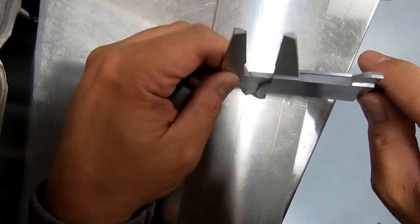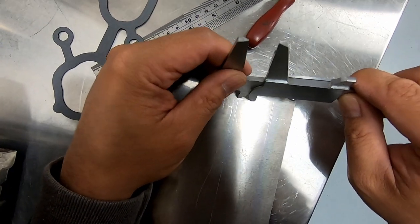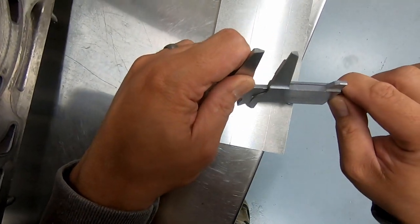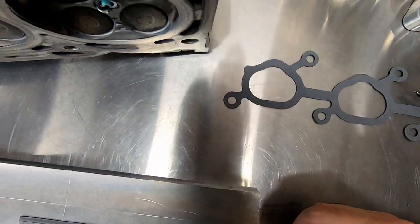Now we can measure out the port spacing and center punch the points in which we drill out the pilot holes for the hole saw. Find the edge of the port and halve the diameter of the hole saw to find your center point for the hole saw. Then mark this onto the plate so the radius of the hole saw matches the port. That is 2 points per port.